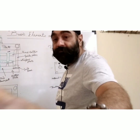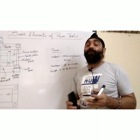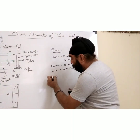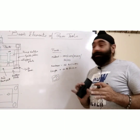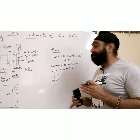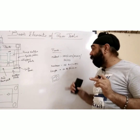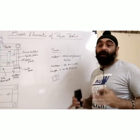Now let's go ahead with the punch. The punch shape will be according to the profile to be cut, and you select raw material accordingly. The material used for the punch is die steel and alloy steel — OHNS, WPS, HCHCr, D2, D3 — according to the application. Hardness and tempering of the punch will be 58–62 HRC. The length, that is the height of the punch, will be 60 to 80 mm.